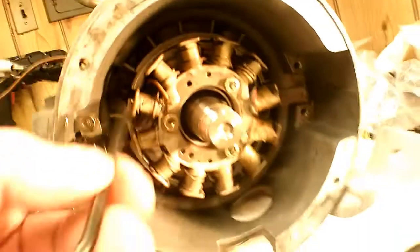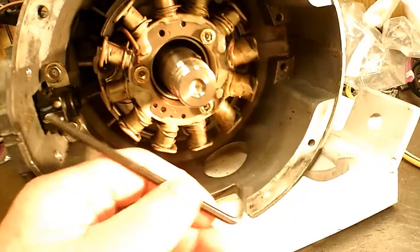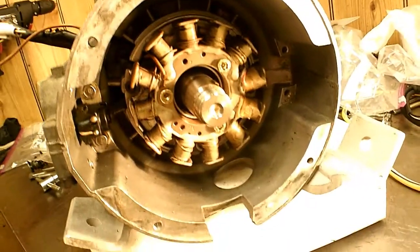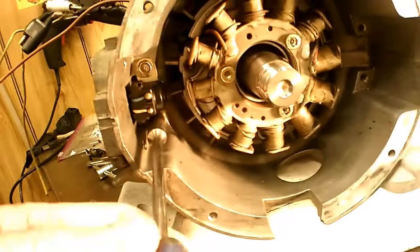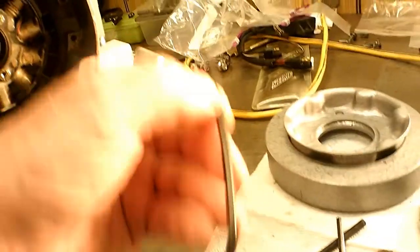The only thing I'd say that was a special tool I used is you have quite a hard time getting the screws in there and tightening them up unless you have a long-handled metric allen wrench — so either get one of those or a T-handle one. I just use this one, put it on the screw and then use a crescent wrench to tighten it. The other tool that comes in handy is an 8mm nut driver to tighten these screws, which makes it easy to get to them. I'd recommend getting a whole set of metric nut drivers and long-handled allen wrenches before you start on a project like this, because some things are down in there and they're pretty hard to get to.